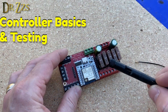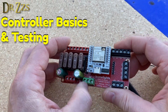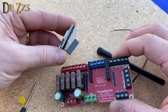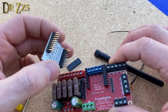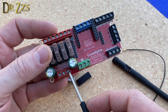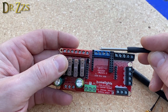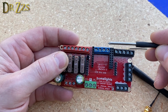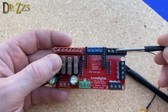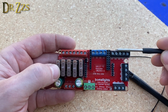If you buy a controller on the Permatrac website right now, this is what you get — it's a modified version of the DigQuad with an external antenna and a controller on top. The top piece comes off; everybody freaks out when that happens but it's not a problem — those pins aren't used, it's just there to stop those pins from contacting anything else. We're going to put positive in here and negative in here from our power supply. The data comes out here; we've got four different data outputs and we're going to use two of them on this project. This is how we power the LEDs — these are the negatives and these are the positives.